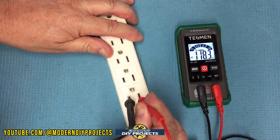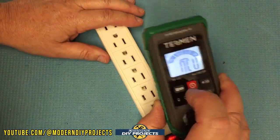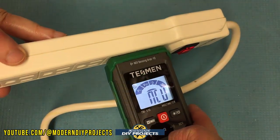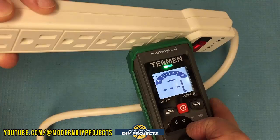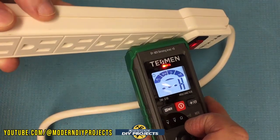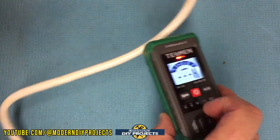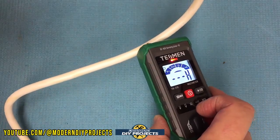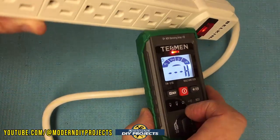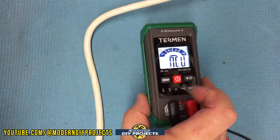For the non-contact voltage testing, select that mode and it goes to non-contact voltage. Put it next to the wire and you see it's testing live. It depends which one you're next to — that's the hot wire there, that's the neutral on that side. So it tells you which one is hot and which one is not. Put it next to the wire and it shows you it's a hot wire. Take it away and nothing. Put it right next to it and you have the hot wire detected — they're spaced out here so you can see neutral and then the live one. It worked perfectly fine.